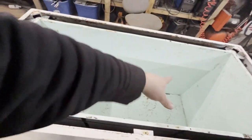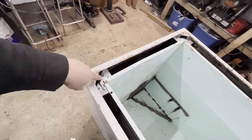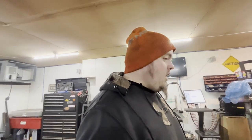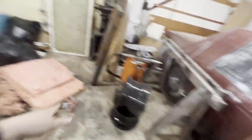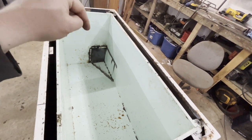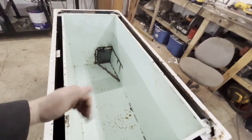So I've got my studs in there underneath. I haven't screwed it down yet - I'll wait towards the end and self-tapper it in. I made these little aluminum brackets to replace the original ones, which were actually made of wood on the original freezer - so they obviously won't work. I got rock wool for insulation; this stuff doesn't burn, so I'm told. The door is all insulated. I'm going to cut my heater hole and thermostat hole, then pull the tub out, lay insulation in, put the tub in, and work on the flashing. Making progress.